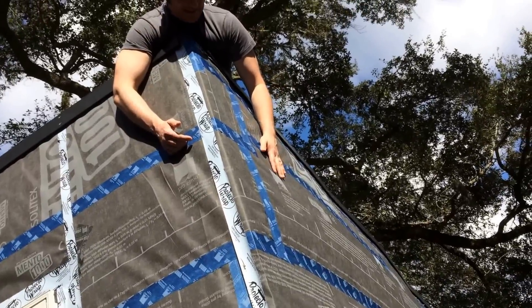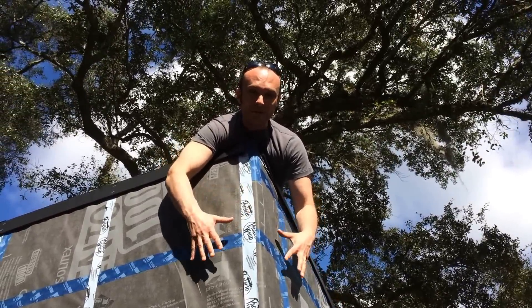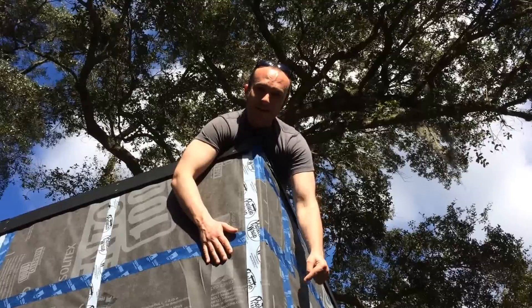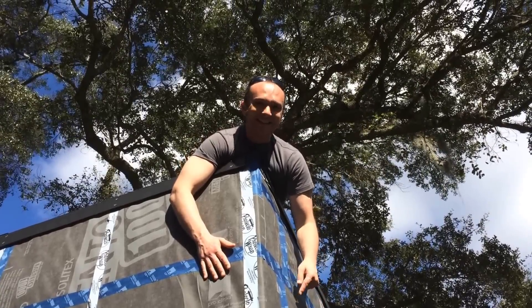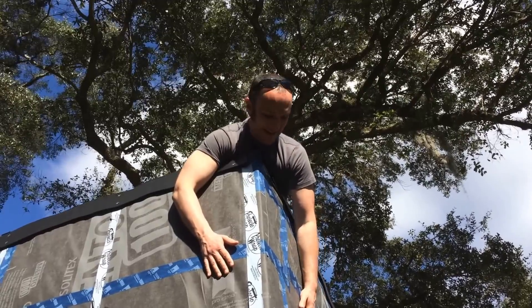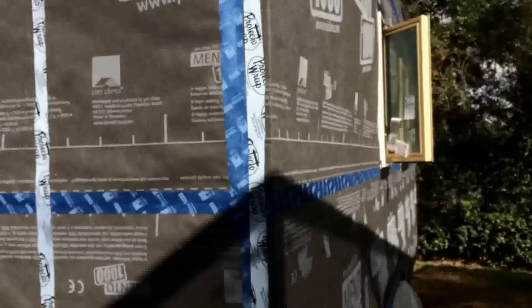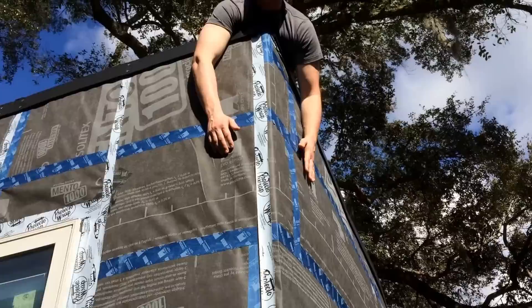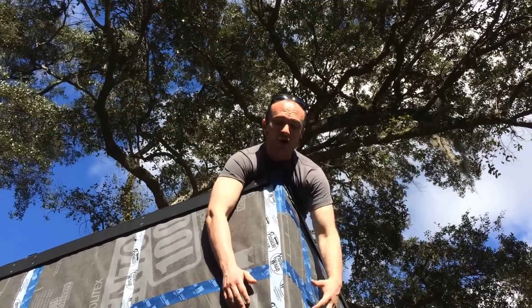It's stack effect. You can see that it's ballooned up — I have essentially made a hot air balloon out of my house. This is air that's being contained between my exterior plywood sheathing and this airtight seal. And I know for a fact that this is airtight because I have it trapped in there. As you can see down at the bottom, it's perfectly flat. Stack effect is dictating that there is a high pressure system at the top where all of the air is trying to be, because the sun is beating down on this black shroud, heating up this air behind it.